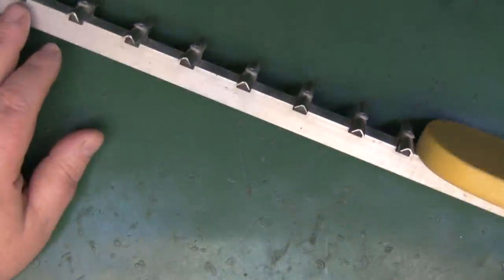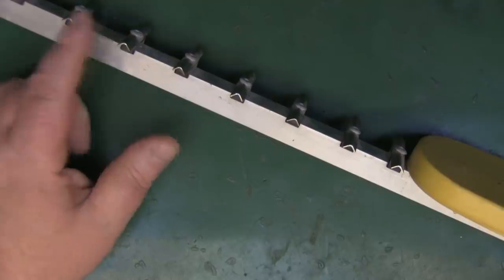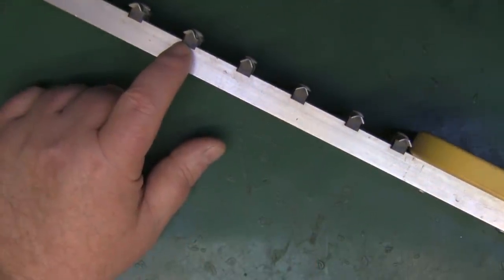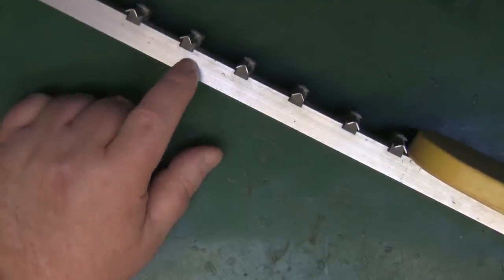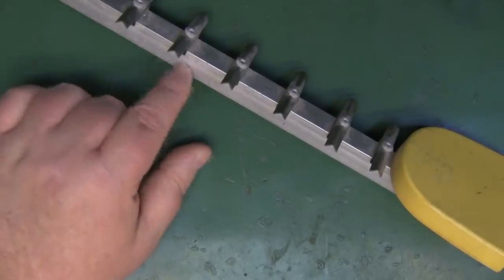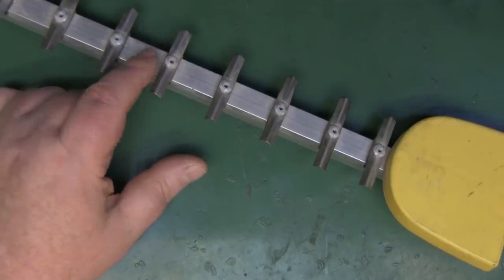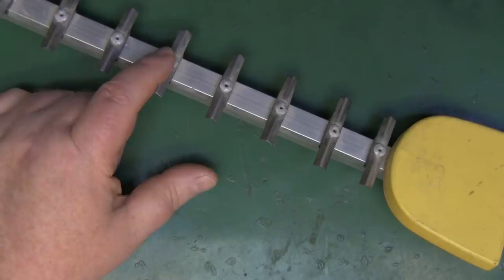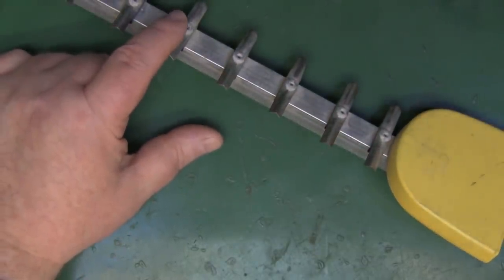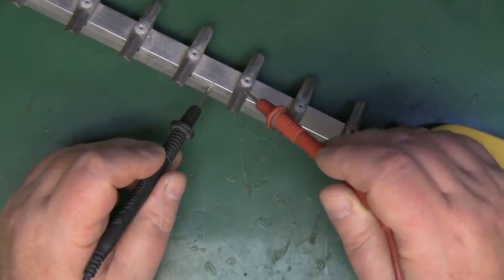The way they've gone about building this Yagi is a little unusual — I haven't seen one constructed like this before. The elements are on an aluminium box-section boom, and under each element there's a plastic piece acting as an insulator between the boom and the directors. However, they've also got some metal rivets on top holding the elements in place, so I'm going to check continuity with my multimeter. As it turns out, the element is completely isolated from the boom.